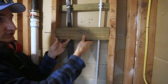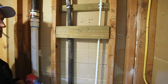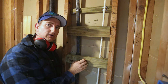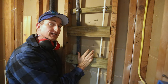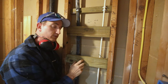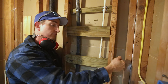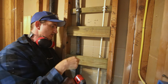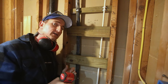I'm going to use some scrap lumber — lumber is actually really expensive right now, so save your scrap. I'll screw it in with deck screws. The block on that side will be for the bottom safety piece of hardware that keeps the mirror from slipping. The mirror slips on hinges, and this bottom piece will have something that screws into the wall to keep it from pivoting out. It's a little tricky to drill in here, so I'm going to toenail in from the wood — it's a nice snug fit and that will make a good connection.